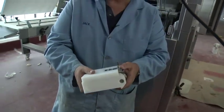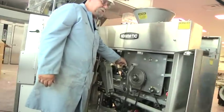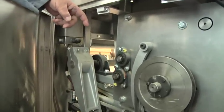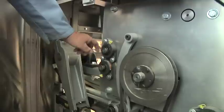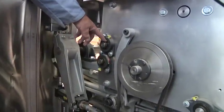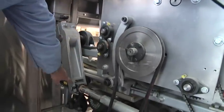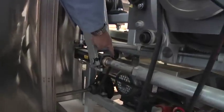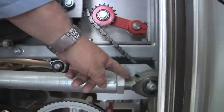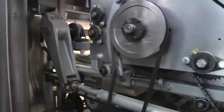For cleaning and greasing — no hot water. As you can see, all the grease fittings are sealed bearings; these bearings don't need a lot. Everything turns very slowly up in here — it's not high speed. The most important grease fittings on this side of the machine are here: one on each side of the hydraulic cylinder, and one on the crank plate. Those three are the most important on this side.